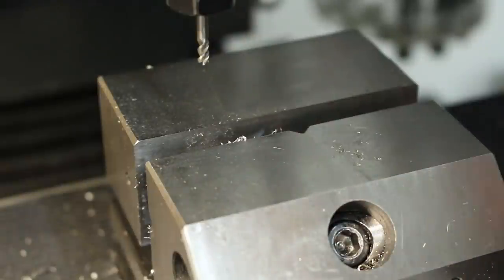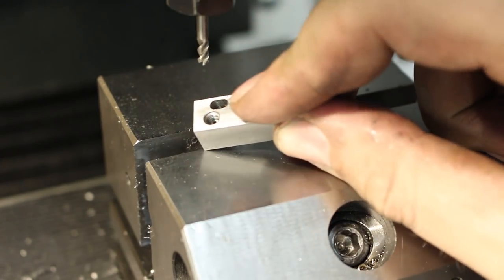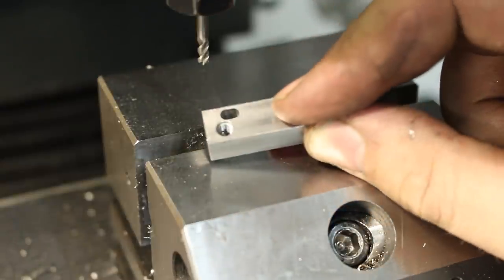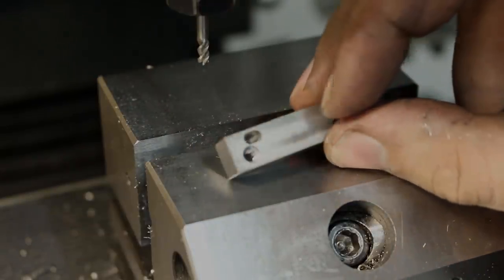It paid off to go only 0.5 millimeters per pass in depth. And you have to be very careful not to overrun the end of the slot. So either dial indicators or even better a DRO on the milling machine are very helpful for such operations.